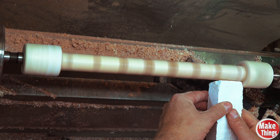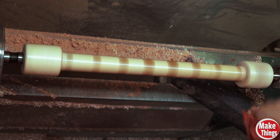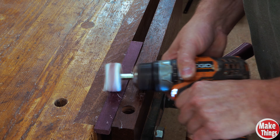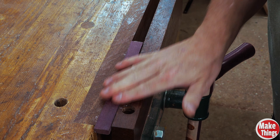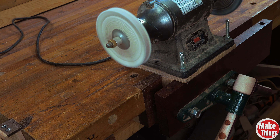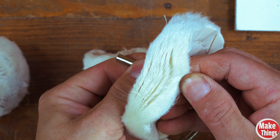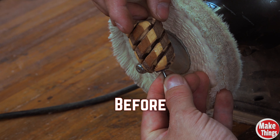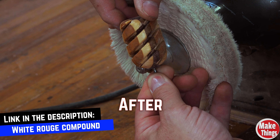To use white rouge, I add it to my lathe projects and crank up the speed using a cloth to finish. The same can be done with a buffer or buffer attachments that fit into your drill. If you use buffing equipment, it should never be used on metal, which can stain your stock. You should always use cotton or muslin buffs. We are, after all, adding a very fine finish with this process. I have a link in the description for a stick of the stuff.